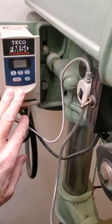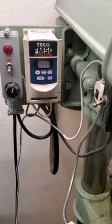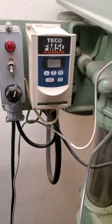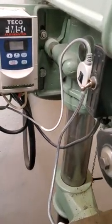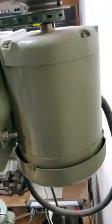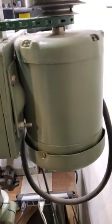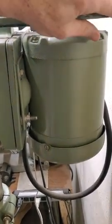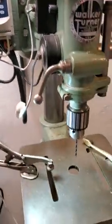Someone just mentioned they don't make this model VFD anymore, but I'm sure there are others that are suitable. This takes 110 — just household current — and converts it to 220. So I've put a 220 three-phase motor on it, which is a three-quarter horsepower motor that bolts right up to the same mounting plate. The VFD converts the 110 input power to three-phase 220 to run the motor, and because it's three-phase it has infinite speed characteristics.